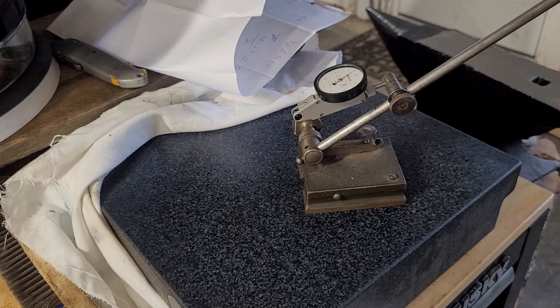That's also another thing. If you get a crazy reading, check for dirt on the plate and check for burrs. Because a lot of the time, you don't have to deburr as aggressively when you're grinding, but it is good to check. Don't make the assumption that everything's clean and deburred, even though you did clean and deburr it, because you can miss a face just like that.